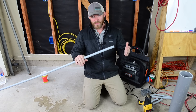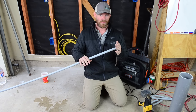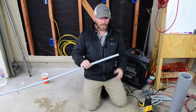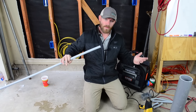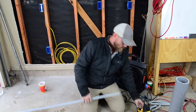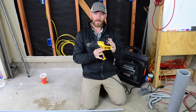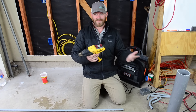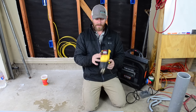Sometimes you're going to run into situations where you need to bend a 90 or a 45, some kind of offset with PVC conduit, and a lot of people wonder how the hell you even do that. What I have is this Wagner 1500-watt heat gun, which is essentially just a blow dryer but a super blow dryer — it puts a lot of heat on.